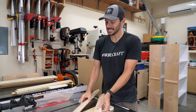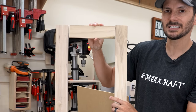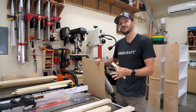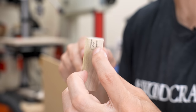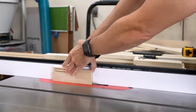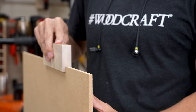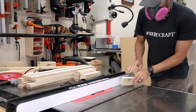I cut down the door frame parts to size. We're going to have two uprights that run the full length of the door, with a top rail and a bottom rail connecting them. There will be a quarter-inch MDF panel inside, and I'm going to cut a groove to capture it so it fits right in between all the frame pieces. I'll start by making the center groove on the table saw — one pass, flip around, another pass, widening the gap until it fits the panel perfectly. After a few dozen runs, I got it just the way I want: not too snug, slides smoothly with just a little friction. Now I can run all the parts through and get the same groove on all of them.